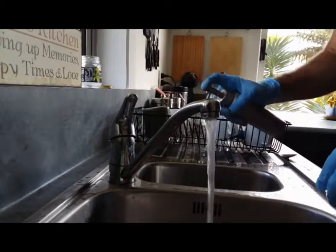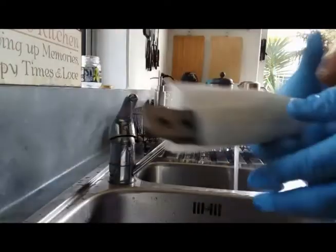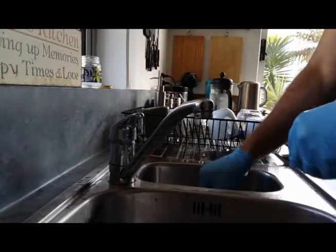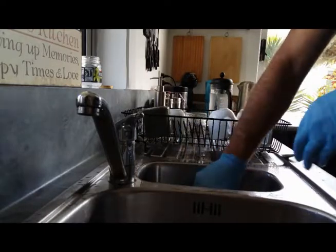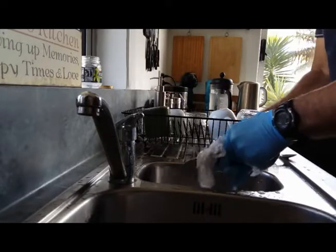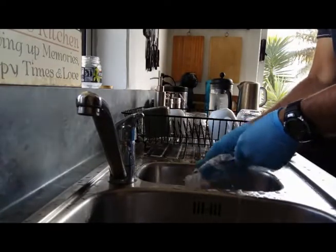Washing up liquid. Here we go. And one. Two. And a white cloth. Again, trying to reduce any chance of anything that might have dyes or colours or oils, anything that will go onto the steel, because that reduces it. This is the one thing I've found. This and warming the steel carefully are the main things I've found to give me a really good bond with the ATP. I get virtually no, well, I don't get any decarb at all. There's nothing. The blades come out absolutely clean and take 2 minutes to clean up.